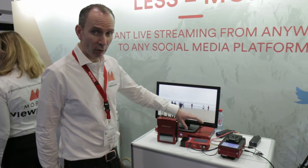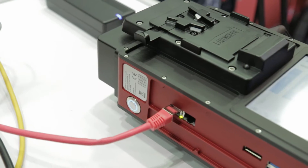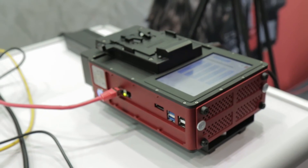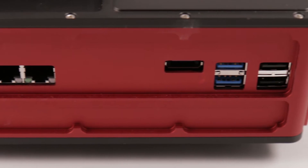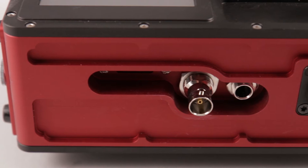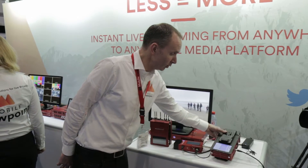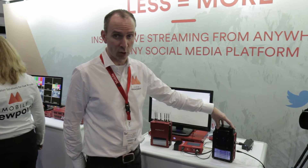Our mobile units are available from our portfolio. On the right side you see our most selling equipment, that's the LiveLink. It does H.265 and H.264 encoding and offers excellent quality for HD at around 4 megabits all the way up to 20 megabits. The unit has 8 built-in modems — the SIM cards go below here under the lid. On top there is a built-in antenna array which you can take off and connect external antennas as well.